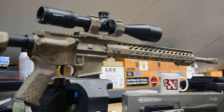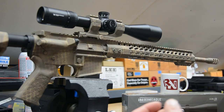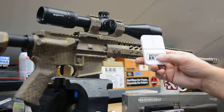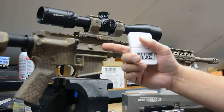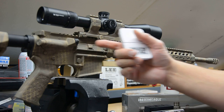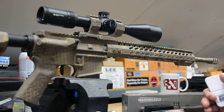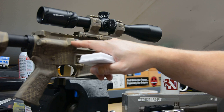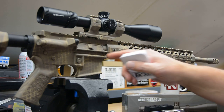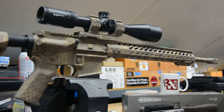The other thing I added — which I have on my other ARs — is something I picked up from Loads of Bacon off the Reloaders Network. He had a YouTube video that led me to it: a deflector brake. When your brass comes out and hits this brass deflector, it cushions it so you don't dent your brass. It makes it a little quieter, and the nice thing is the brass bounces off and lands in a nice pile about two or three feet away, making it a lot easier to gather up. It protects your brass and protects your gun's finish — one of the reasons I put it on this one.